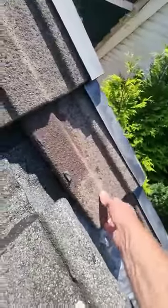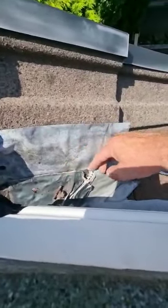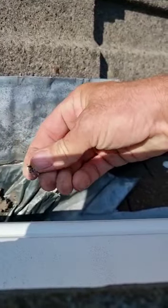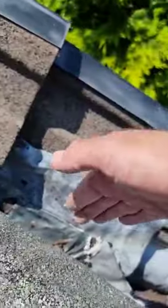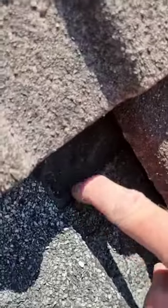Which is actually this tile — the tile is loose. There's obviously been some sort of leakage because they've just stuck — this is white silicone, and then this is flashband, which is sticky tape for roofs, a 20-pounder roll. That tape has been shoved on top of that piece of lead so that the water can come down — which is not really good practice. You've also got exposed edges here.